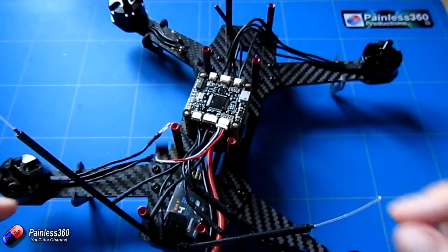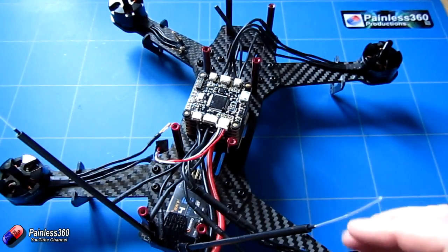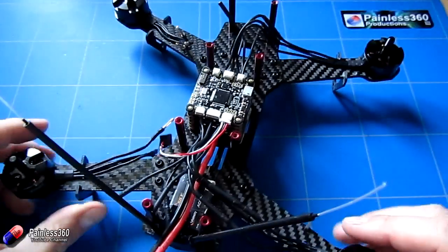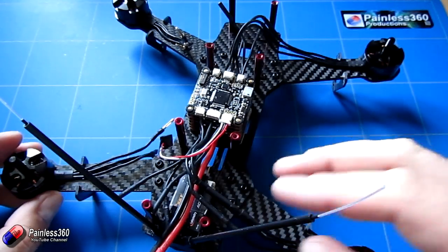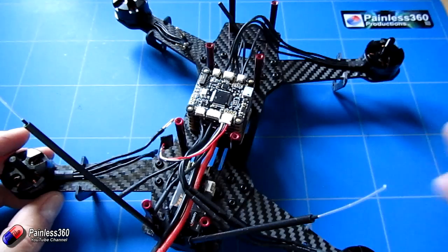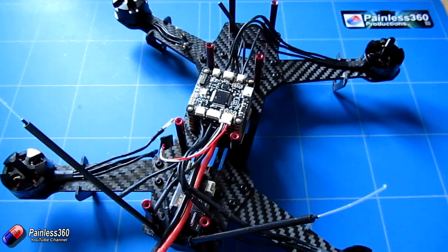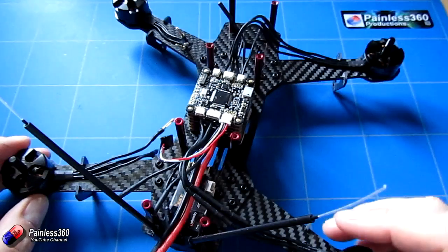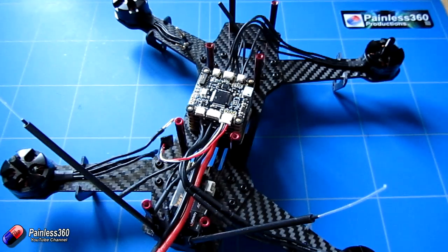Let me plug this into the receiver at the SBUS signal output, and then we can go to the PC and plug this in for the first time. We're not going to power it with a flight battery just yet — all I want to do is make sure everything is happy. The reason I've plugged the motors in beforehand is that I always like to make sure output MOSFETs are connected to motors when powering up with ESCs attached, as you can get into trouble with some ESCs if they're on for a long time without motors connected. It's just a precaution and an old safety habit.